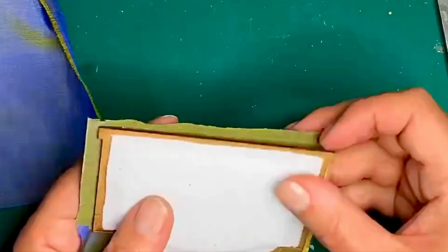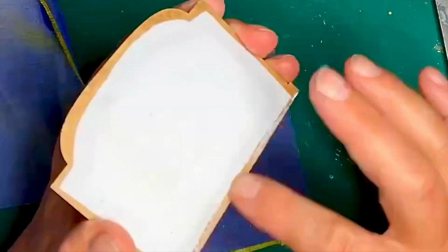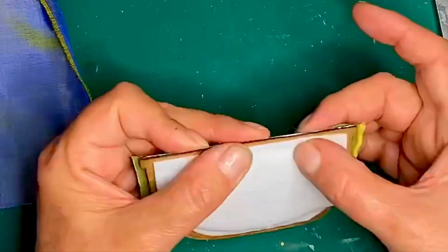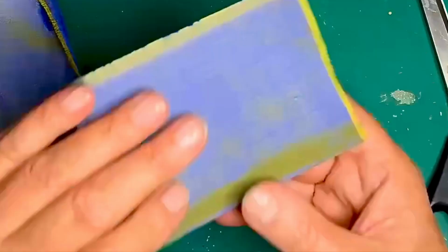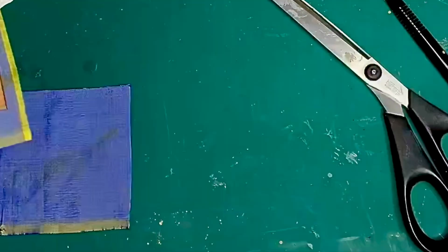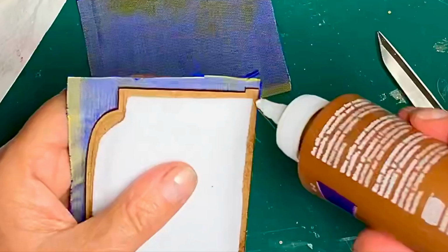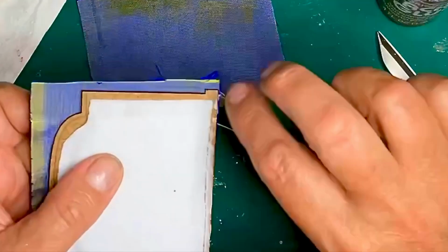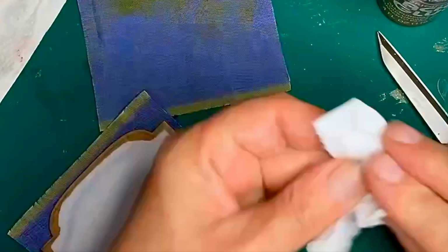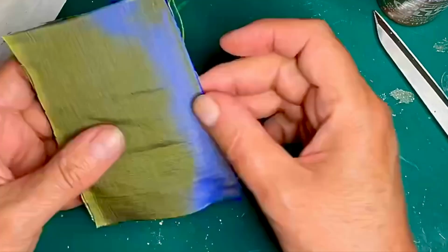Next, cut 4 rectangular pieces of fabric, just slightly bigger than the bed ends. Pay attention to the direction of the weave and, if necessary, the pattern of the fabric so that it all matches. Then put a little bit of glue along the bottom edge of the bed end, and again use the glue sparingly, and attach the bottom edge of your fabric to it. Leave that to dry, and in the meantime do the same thing on the other 3 sides of the bed ends. Be very careful you don't stain the fabric with glue that's on your fingers or on your workbench.